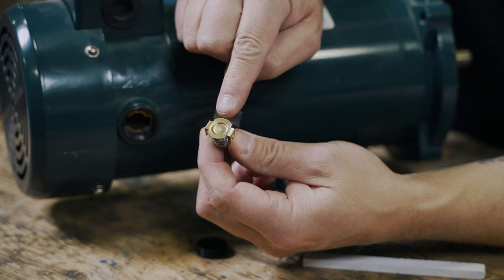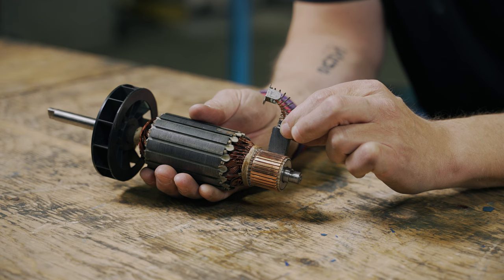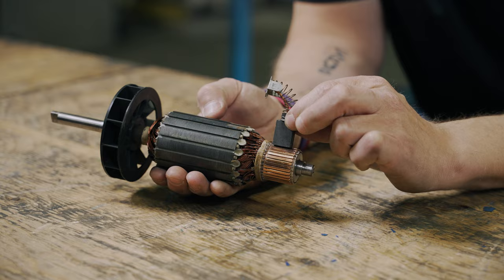First, let's discuss what carbon brushes do in an electric motor. The brushed DC motor uses carbon brushes to bring the current to the rotor to create the magnetic field that causes the motor to spin. The carbon brushes are the bridge between the stationary wires and the spinning apparatus of the motor, sliding along the commutator sections to conduct current. Constant contact between the brushes and the commutator is required for the motor to operate properly.